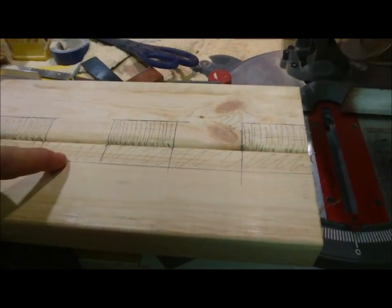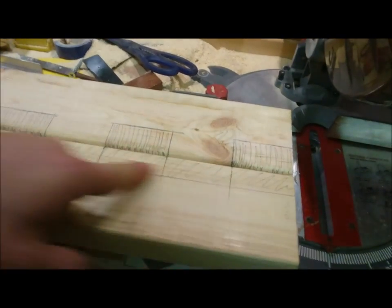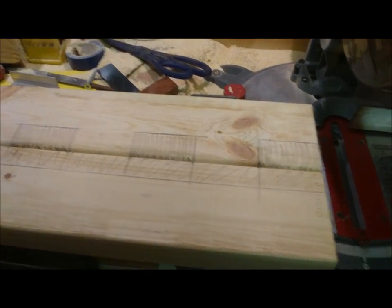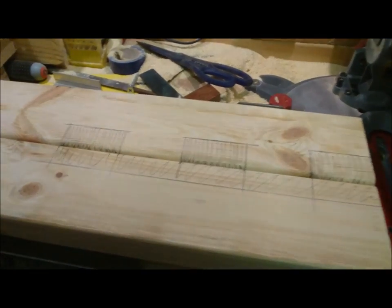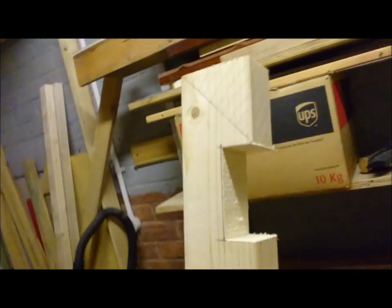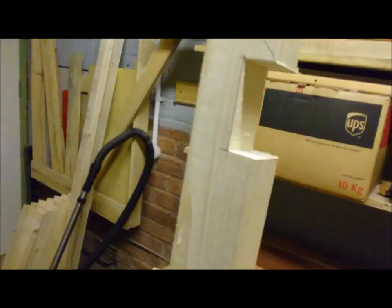Here's one of the changes made from the original plans. There was originally going to be five pieces of stud work stacked on top of each other forming a headboard, but I decided it would look better and more in keeping with the design if there were just three with gaps in between. The horizontal rails you can see are going to be secured into the upright post with pocket holes — just two screws put into the ends on a slight angle going into the rebates at the top of the post.